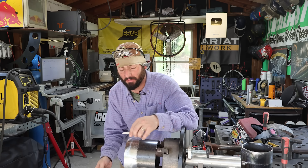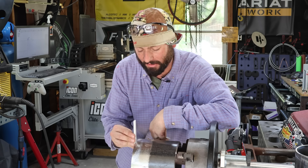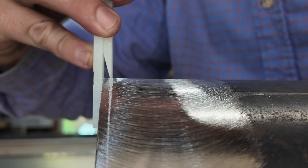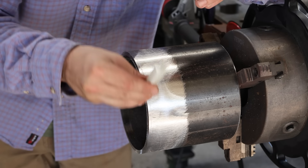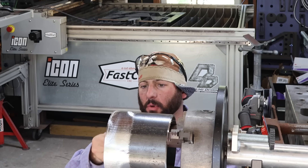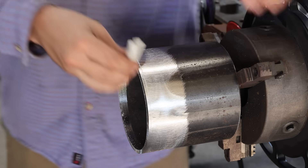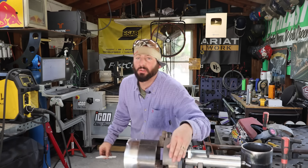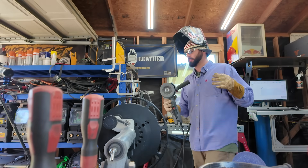The other option — my personal favorite — is running one of these fiber discs. It's crazy how much metal a thin piece of paper can remove. One last trick: where to stop on the back side of the bevel edge. This was taught to me by a friend named Jeff Pasket. Take a flat piece of soapstone flush against your edge, then take a second piece with a slight taper that doesn't quite reach a quarter inch, hold everything flush against the pipe, and run that sharpened soapstone all the way around. That line marks the back side of your bevel — you know when to stop grinding.